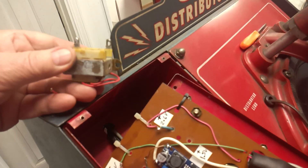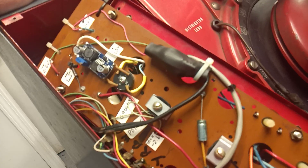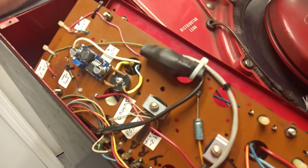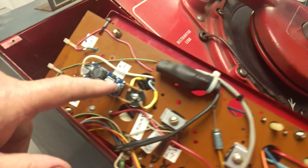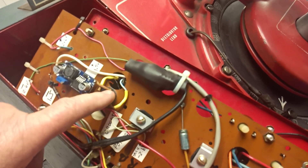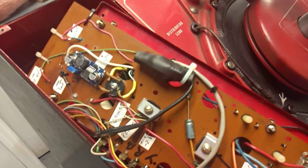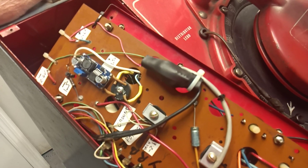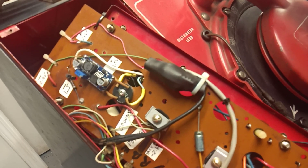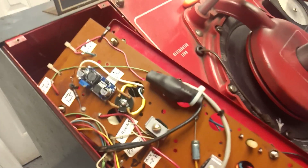You can use a little transformer, but most of you have had a few cell phone adapters — those 5-volt sources are nice to power these modules. This takes DC in; the bridge rectifier converts AC to DC, so you could feed one of these 5-volt wall warts right into one of these. You need one for each LM2596.